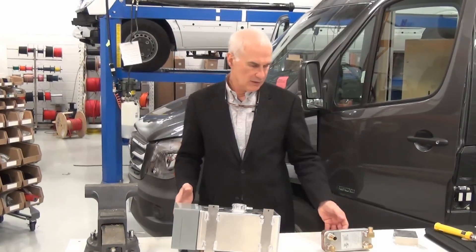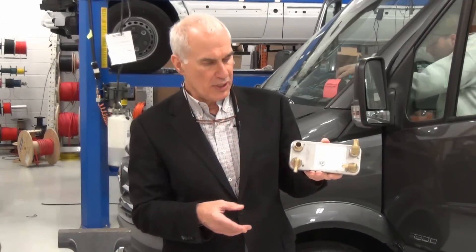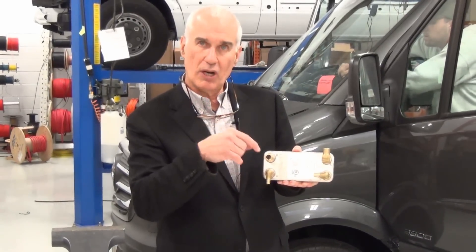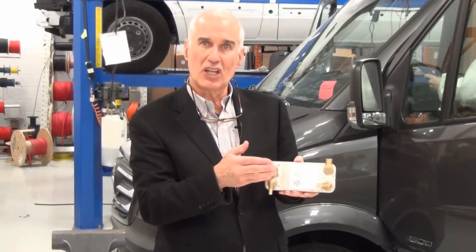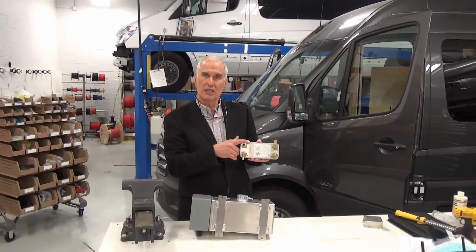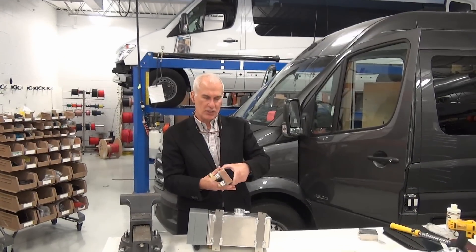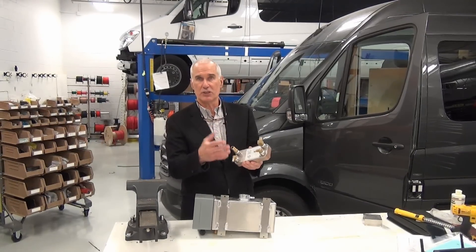The other piece of the system is the hot water heat exchanger, mounted under the chassis, so there's no hot water tank to worry about when winterizing, no room taken up by a hot water tank or furnace inside, and our system is much quieter than typical RV heating systems. When hot water is required, the pump moves water in one side and out the other, and the glycol is pumped indirectly on the other side, giving up its heat to the water. The glycol is heated to about 190 degrees Fahrenheit, so as soon as you call for water the glycol circulates and you get hot water on demand. It's very small, very efficient, and on-demand, so you don't have to store hot water.